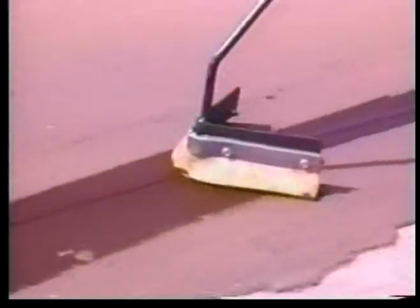After the 6 by 40-foot section is completed, the home run must be sealed. Notice on these close-up shots how much sealant is needed to fill the slot properly. Again, follow the pour pot with a squeegee, striking off excess sealant as you go. Since TA-500 doesn't adhere to automobile tires, traffic needs only to be stopped momentarily while the home run is being filled. Traffic can be released immediately following completion of the home run.